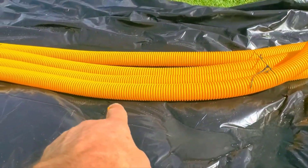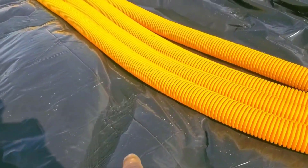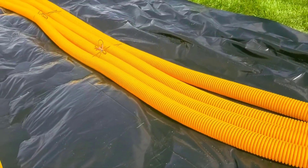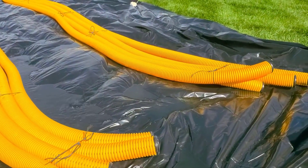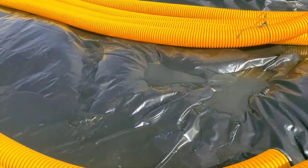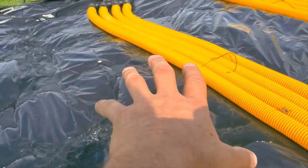The knife cut is still leaching water — look at that water running out of the knife cut, because we loaded them both with the same half-horse Liberty. I actually have to wait for the leach pipe to stop leaching and do its job. But there's no water in this eight-slot pipe at all — it's as light as a feather, because it all poured right out at the top.